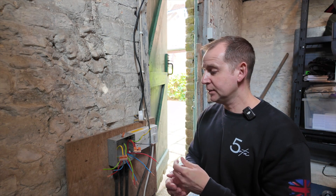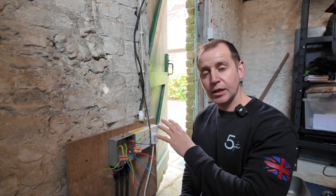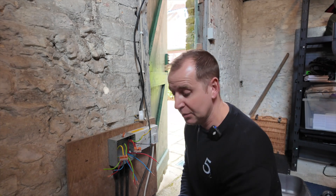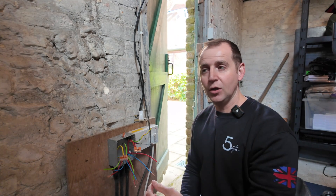Next I'm going to put those conduit box cables into WAGO boxes, connect everything back up, connect the switch back up, and turn it on. If it trips then this will be the issue. I'll make sure that all my supplies to the conduit boxes are live.